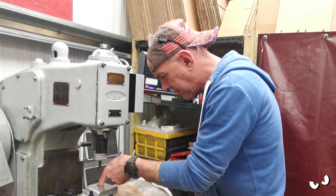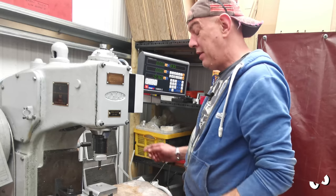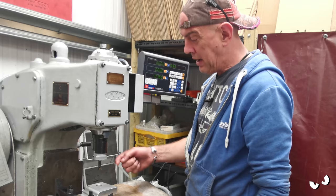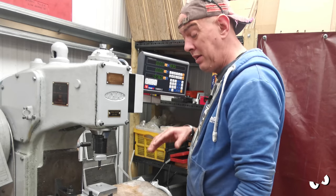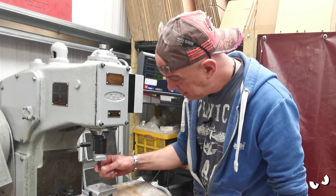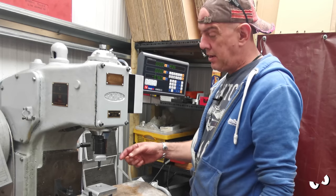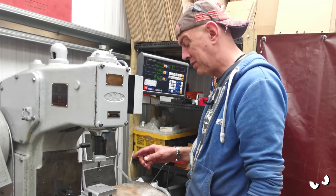And also, I've been boring out stuff wrong. Something else to add to the list. Brett was in here yesterday, and the way that he was taught on his apprenticeship is that you bore the hole out, and when you get to your final dimension, you bore it out, stop it, retract the tool, it will leave a line up your bore, and then you don't change any of the settings, you just bore it again. You probably do like three or four bores like that, because there is going to be a tiny amount of flex in the tool, but by doing three or four runs through it, you know that the boring bar has centralised itself and your hole is on size and it's not taking off any more material.